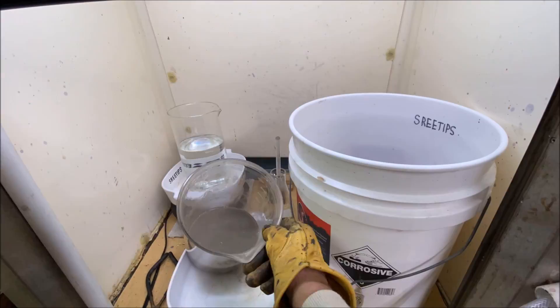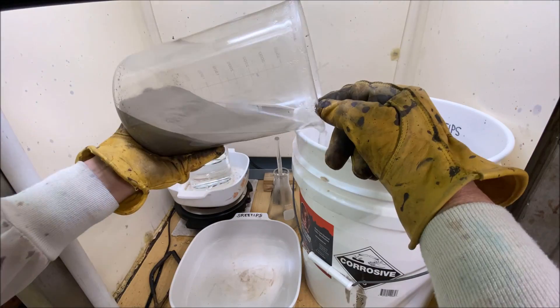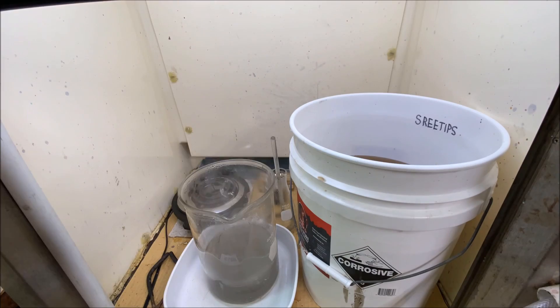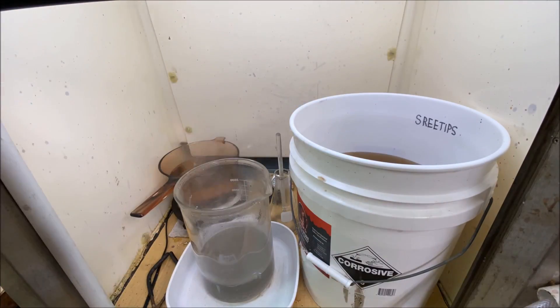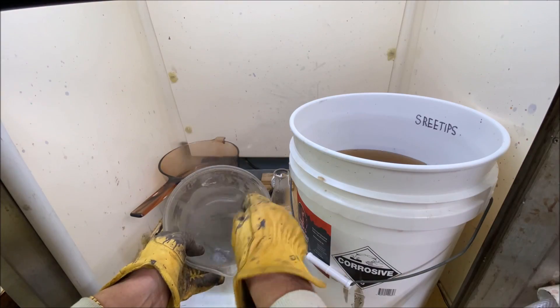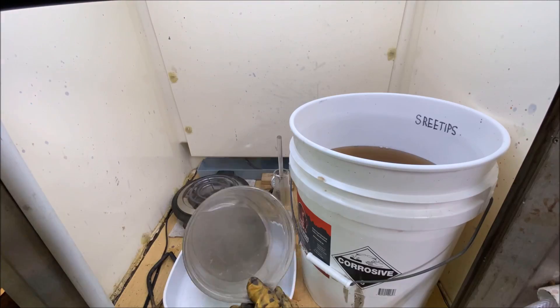In this particular conversion, I didn't pay close attention to getting all the impurities filtered out of the silver solutions before converting to silver chloride, so there's probably a little bit of other metals in there — maybe some gold, maybe a little bit of platinum group metals. But that doesn't matter because we're not going for high purity here; we're just going to run this silver through the silver cell.